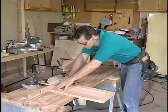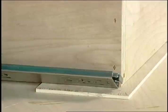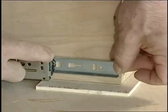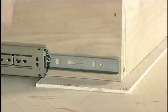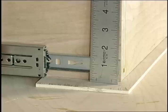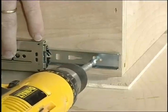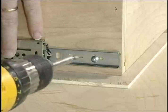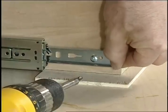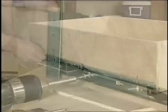Ease both sides of the drawer edges with a chamfer bit — this makes handling easier and softens the look. Before installing the drawer fronts, attach the hardware. We chose 28-inch full-extension drawer slides; they provide maximum extension while still being rated to support 100 pounds. Place the drawer on a piece of quarter-inch plywood — this represents the quarter-inch space we allowed on the cabinet. Using a full slide assembly as your reference, measure the distance from the bottom of the drawer portion to the bottom of the drawer with the slide flush with the drawer front, then attach the screws, leaving them loose enough to allow for final fitting.